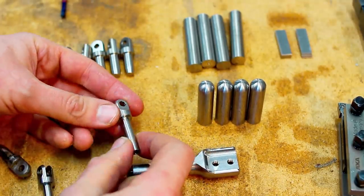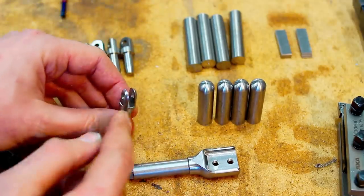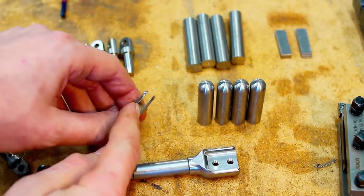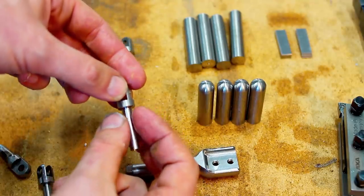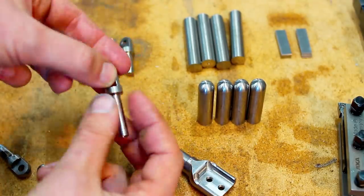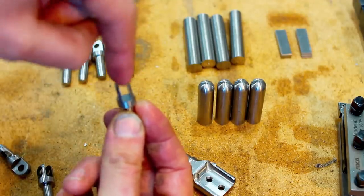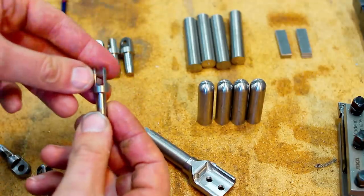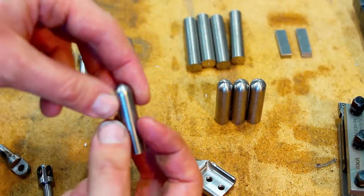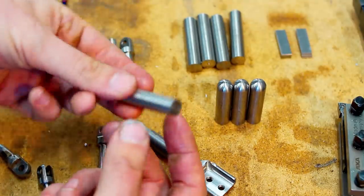The reason why I'm doing the milling and then go back to the lathe is because I'm cutting the slot with a wheel cutter, with a large 63 by 5mm wheel cutter, and I'm not confident that holding the part for milling on the 7mm shank and having all this force from the large wheel cutter acting against the part would be very good. So I'm holding it on the large diameter before I turn it down,